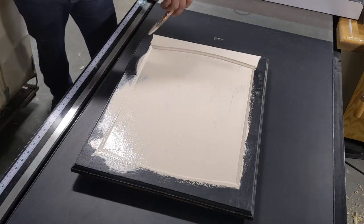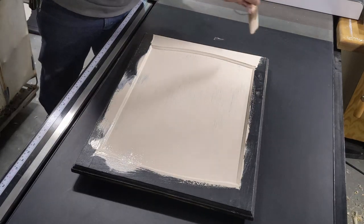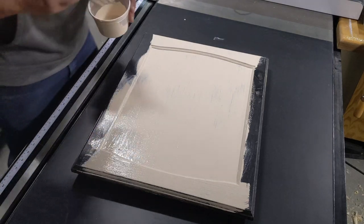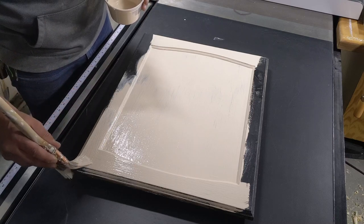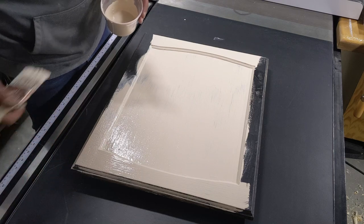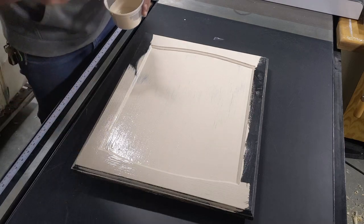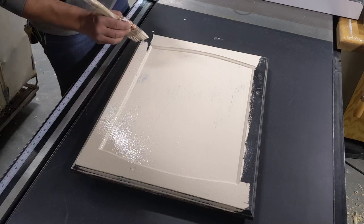Because they're still wet, I'm maintaining that wet edge and I can still come back in and brush through it. Now that looks a bit janky and crappy too, but we'll deal with those in a minute. Come outside, pull back in — you've eliminated all your brush marks there. Then you can handle the rails. Starting on the outside coming in, flaring that brush out to the edge, pull it right back up. It now matches the brush stroke with the way the wood is jointed together. Get that front edge, keep that front edge wet — always maintain a wet edge.